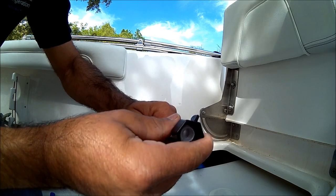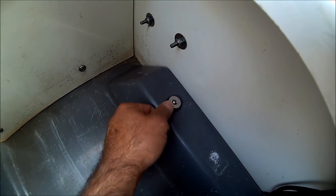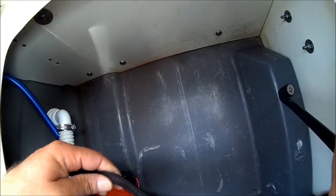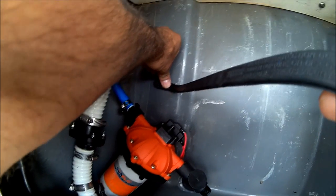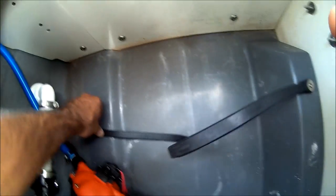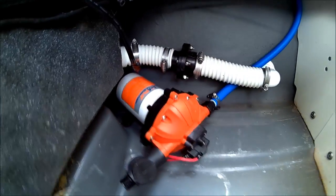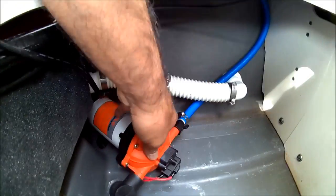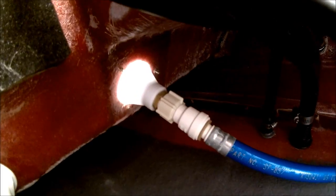This is what you're going to connect your pump to. Connect this bungee now because later you won't be able to access this spot. Put it with the stainless steel washer and screw — it goes over the tank, then another stainless steel washer and screw right here. This is going to hold the tank from any waves or movement. This is the best spot I found to put the water pump, so this hose is not pinched and goes all the way around to the connection.